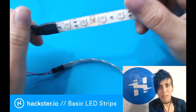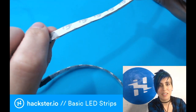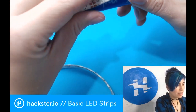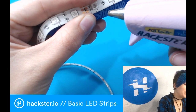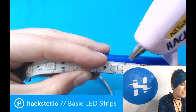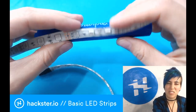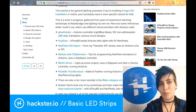When you're ready to attach this to your bike or skateboard or whatever, just peel off the 3M backing, and that'll help you place it. It's not very stable long-term though, so what I do is place it along the tube, stick it down, and that holds it flat. Then I lay down a bead of hot glue along either side, which fills in the gaps between the cylindrical tube and the edge of the tape, and gives it a little more sturdiness.